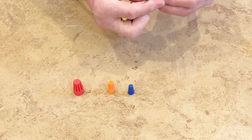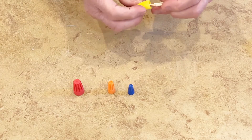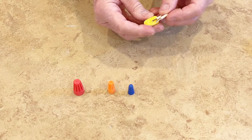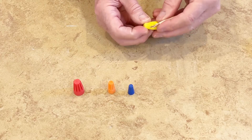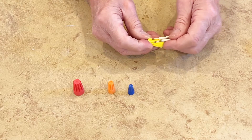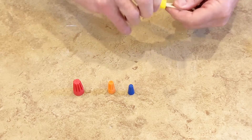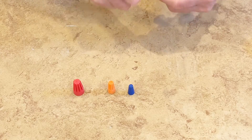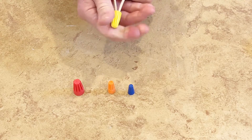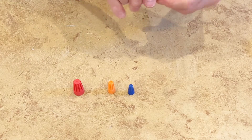Here I'm going to join two 12 gauge wires. I find a wire nut that fits fairly nicely. To gauge how much to strip these, you want to go from about there to there — so this might be a little bit short, but it should work. All you do is press the wires together and twist until you can't twist them anymore. It's a very tight connection that holds forever, and you can undo it quite easily.